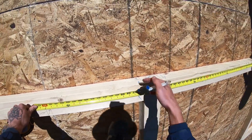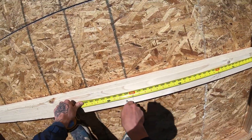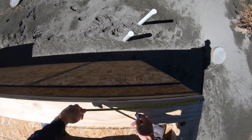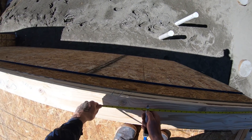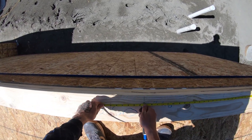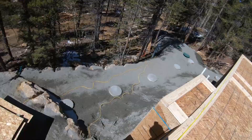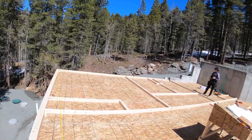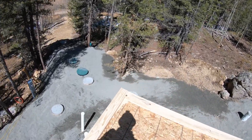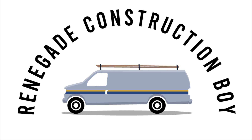The last step, as we finish up the studs, is actually to label the walls. We'll go through and mark on the top of the wall A through Z, and then mark it on the floor too. So if we need to stand it later and don't know where it goes, we can always reference the marks. One of my favorite tools on this custom home has been this 100-foot retractable tape measure by DeWalt — highly recommend it, it's pretty expensive but totally worth it. Thanks so much for watching — wall framing video coming up next. Subscribe and check out our Instagram, Kauffman Construction.